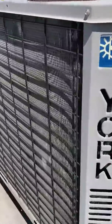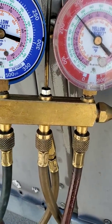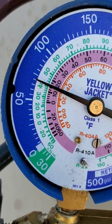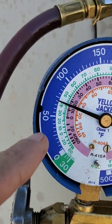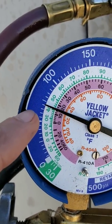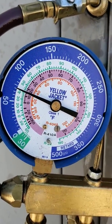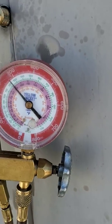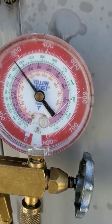Let me go ahead and button this thing up. I'll show you what we're supposed to see on supply and return temps and we should be good. I've got my gauges on. We're reading 65 on the low side, and a little over 250 on the high side. Notice on the green where it says 40 - that's the 40-degree evap coil temp, and that's exactly what you're looking for. Once it gets lower, if it gets around 32, anything below 32 degrees is going to freeze, so your coil is going to freeze up. So it has to be at 40 - that's ideal. For R22 it's 65 low side, over 250 high side.